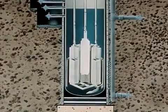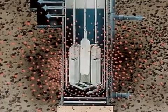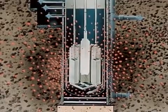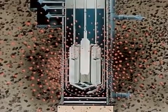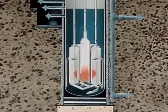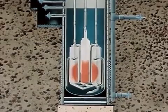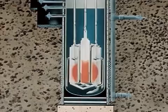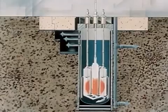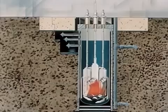This supercritical configuration caused the rapid production of neutrons by fission for a total energy release of approximately 130 megawatt seconds. A metal-water reaction probably contributed 20 MWS additional energy release. The fissions occurring within the fuel plates increased the temperature of these plates to a point near or above melting, depending upon location in the core. In the center regions of maximum neutron flux, the fuel within the plates experienced vaporization temperatures and burst the plate cladding.